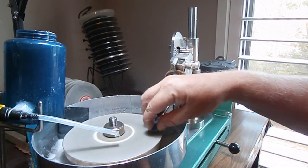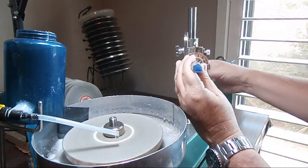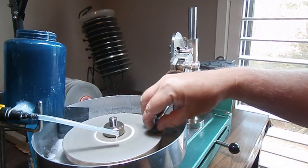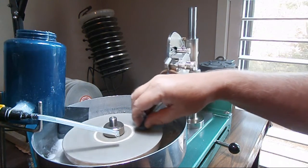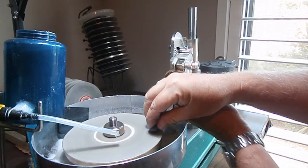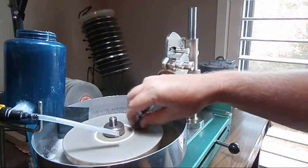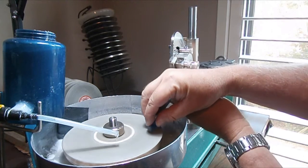So from what I understand, a huge container is used called an autoclave, which is a pressure sealed container of about 3 meters or more in height. This particular autoclave contains a whole bunch of different chemicals and solutions, from sodium carbonate or hydroxide, and then it's seeded with small fragments of quartz. Then the temperature is raised to about 400 degrees centigrade, and the quartz fragments start to dissolve and crystallize into seeds.